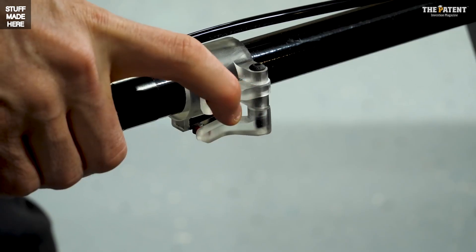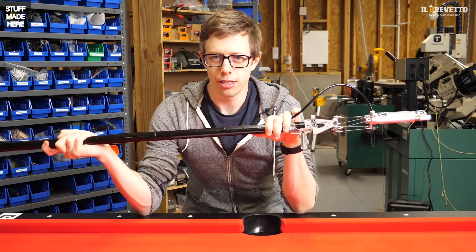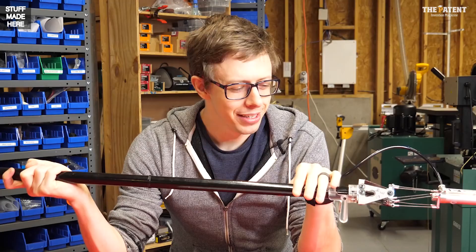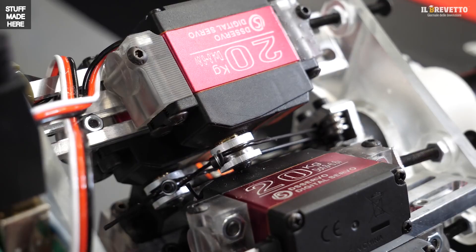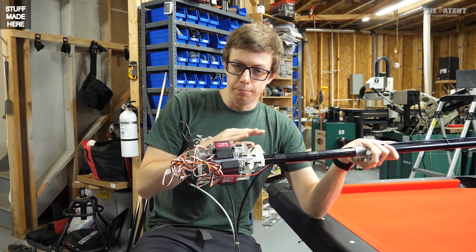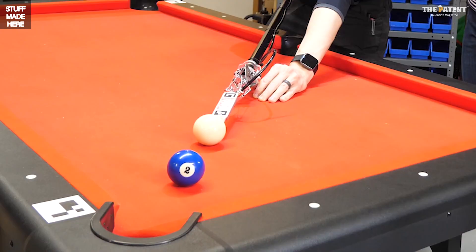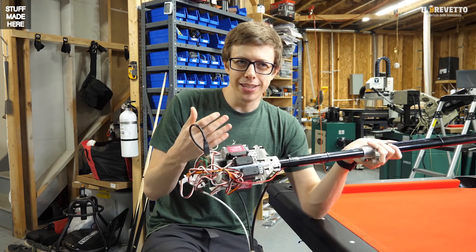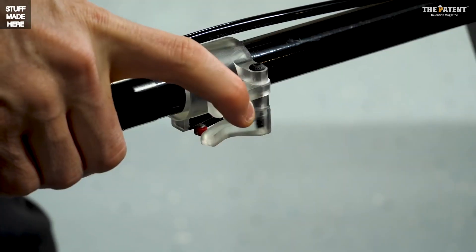At this point it looks like I built exactly the opposite of what I wanted — a pool cue that always misses even on really easy shots. I finally found the problem: the six servo motors controlling the platform end were sold with specs stating how far they rotate, but two of them don't meet those specs. They rotate a different amount than expected, making the end either slightly wrong or really wrong depending on where I'm trying to move it.